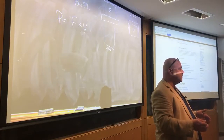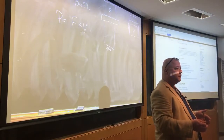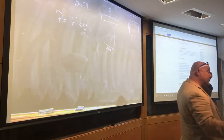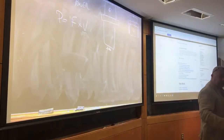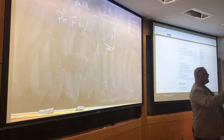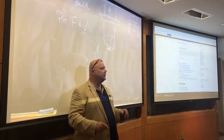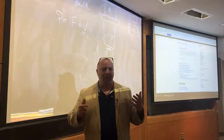What's frictional force equal? Mu times normal force, right? Mu is the friction coefficient. We can look up the friction coefficient between plastic and steel. If we can't look it up, we could get an inclined bench and calculate it, right? All we need then is a protractor and somebody with good eyes to note when it starts sliding. So we can figure out what the friction coefficient is between our workpiece and our material.